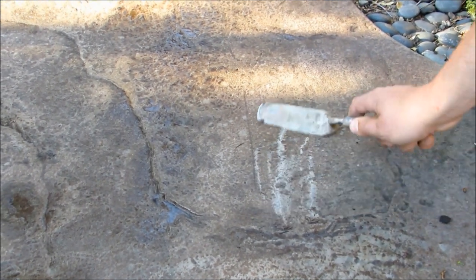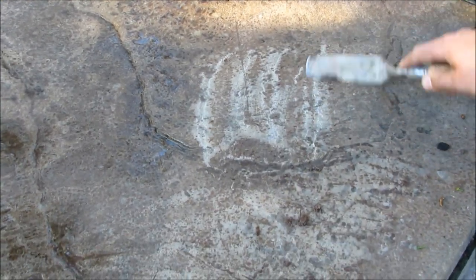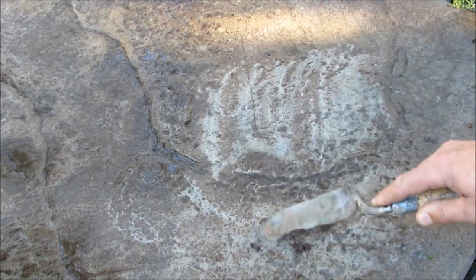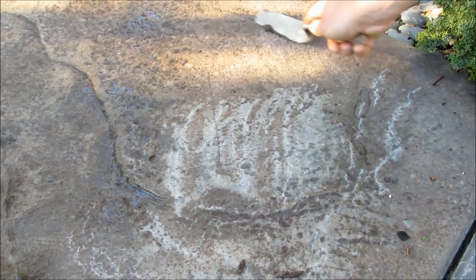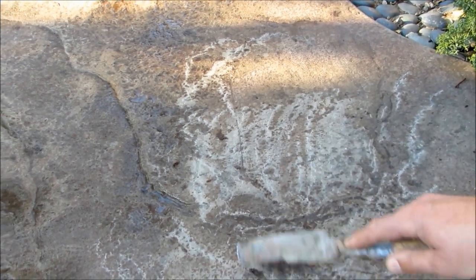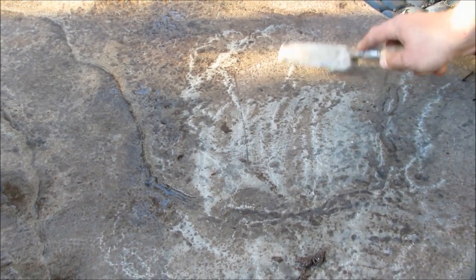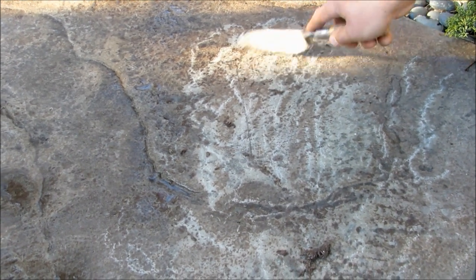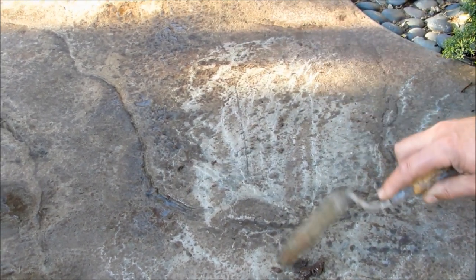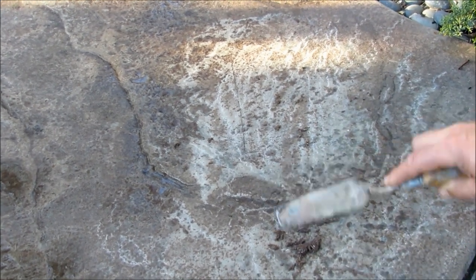We're rolling out across this driveway, and right here — this has been maybe 3 to 4 minutes down — this coating, which we believe to be an acrylic stain and acrylic seal, is just coming off super easy. Roll out the Power Stripper or the Vertical Gel, whichever one you have, and let it do its thing. Once you're ready to remove — which is basically right now — you can start pressure washing, and this coating is just going to come off and give you an unbelievable concrete finish below. It's got great concrete underneath.